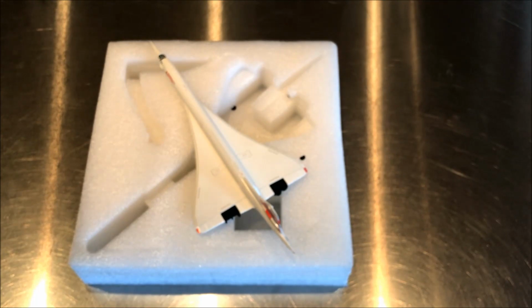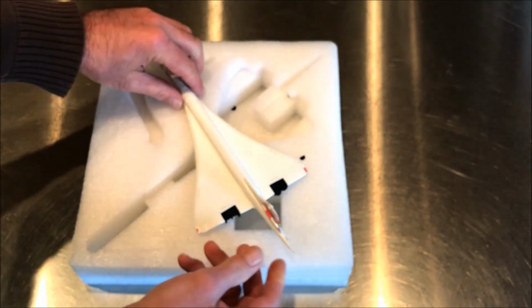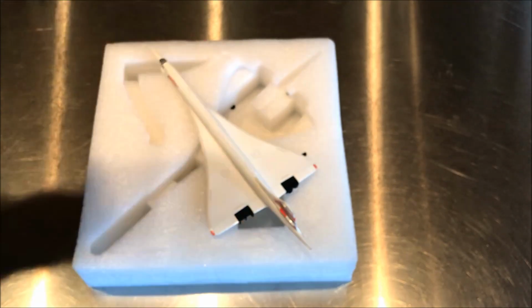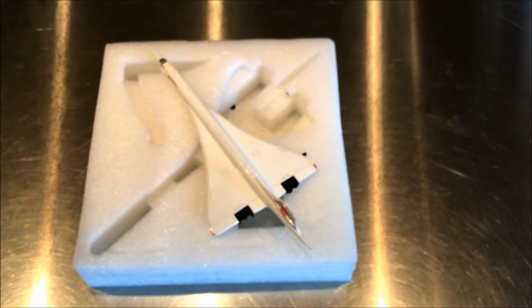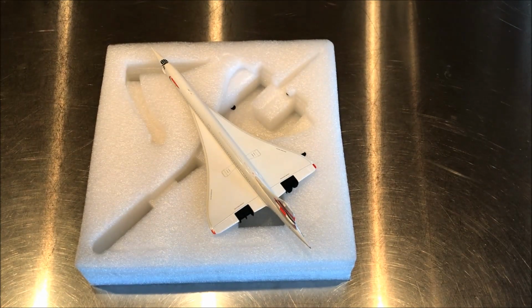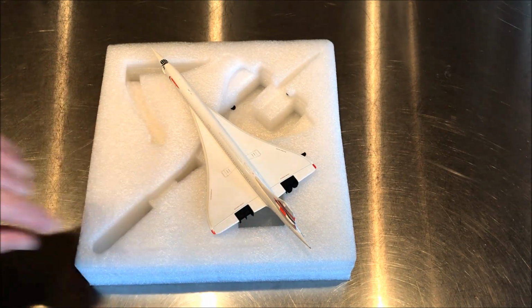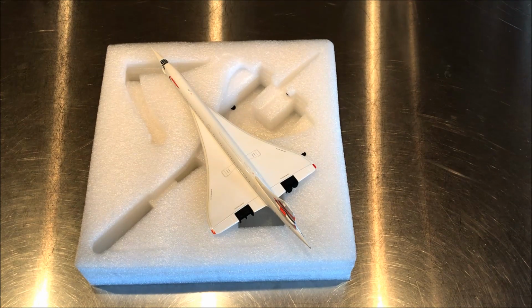It actually produces a lot of its lift at slow speed, during landing and takeoff, at a very high angle of attack. One of its features is that it generates a vortex on the upper surface of the wing, and that vortex is what generates the lift. It's definitely a requirement, and that vortex can be increased by lengthening the wing along the fuselage to generate more of that force. That is another reason why the wings have this very unique shape, the slender delta.